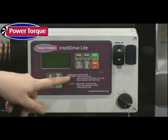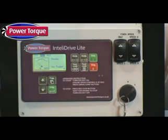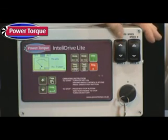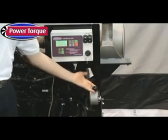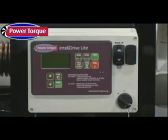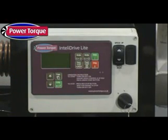There are operating instructions for how to start and how to stop. The most important point, depending on the throttle type, is to ensure that the throttle is at idle position before you start. For the speed switches, make sure they're all open so there's no pre-determined speed before you hit start. For zero to five volt throttles, make sure it's at a positive zero. If there are any sporadic codes that appear in running condition, you can hit fault reset which will clear the fault, unless it's a current fault that is still active and needs attention.